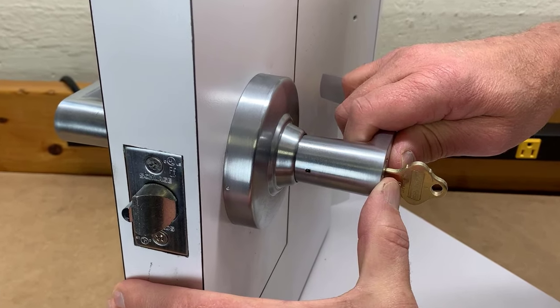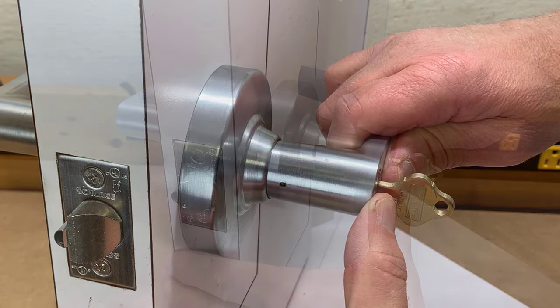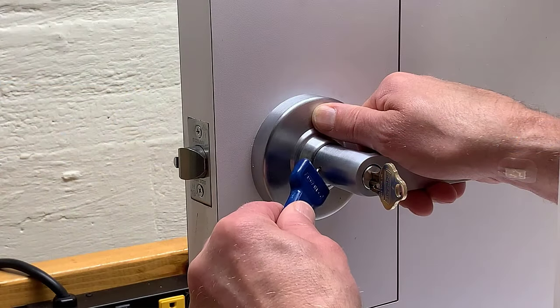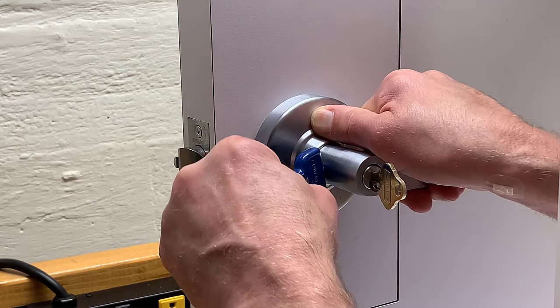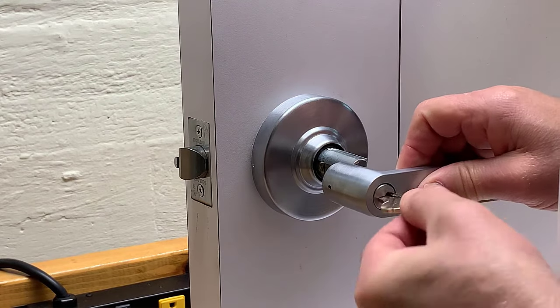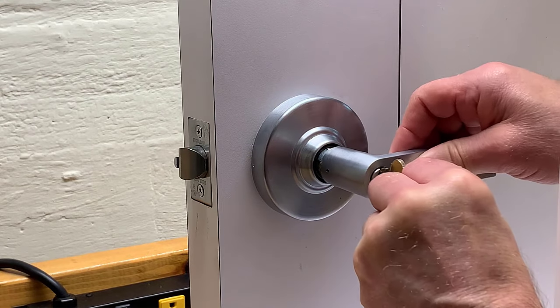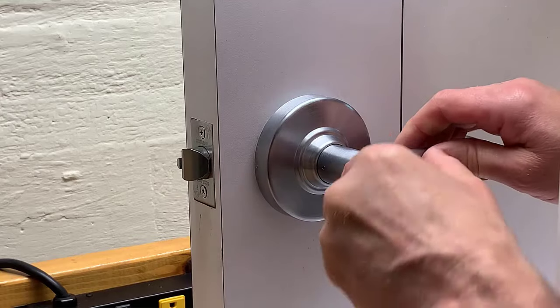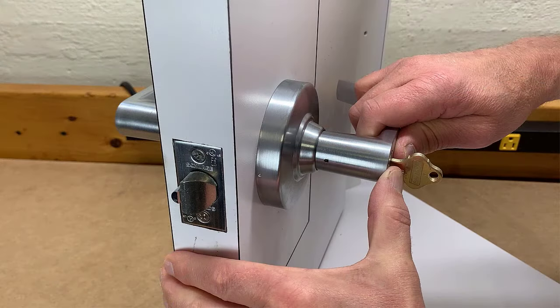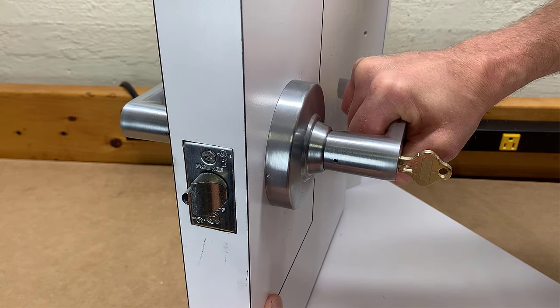If the lever still does not slide over the lever catch, you may need to adjust the lock timing. To adjust the timing, remove the outside lever. Turn the key 1/2 turn so it is positioned in the opposite vertical position. Reinstall the lever. Verify the lever catch is fully engaged by pulling outward on the lever and rocking it in and out slightly.